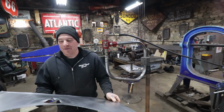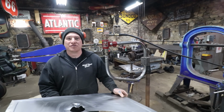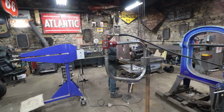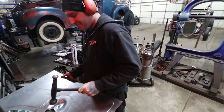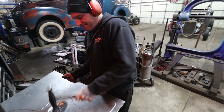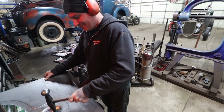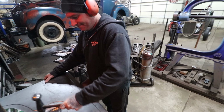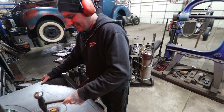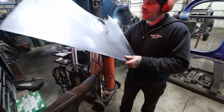We rolled the bead. Everything went smoothly. But I know that I can hammer this back quickly and put it back in the planishing hammer and get it corrected and smoothed back out. So other than some scratches or gouges from digging into the bead roller, I should be able to fix all of it pretty easy. So that's what we're gonna do. A little better.